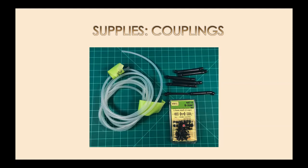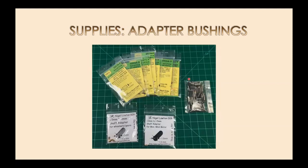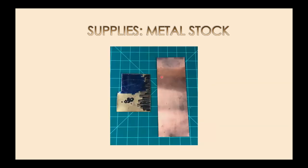Northwest Short Line has cups and balls for their shaft material. When rebuilding a drivetrain or even just changing rubber tubing on an older model, you'll often need to shim out the shafts. Northwest Short Line sells adapters from one size to another; Nigel Lawton out of the UK sells them too. I also use fishing crimps from eBay — Northwest Short Line's specific adapters are about $5 for two pieces of metal, whereas fishing crimps are about $3 for 50, though they're not as precisely machined.